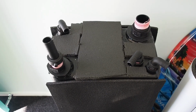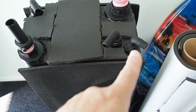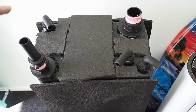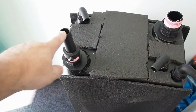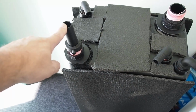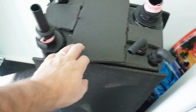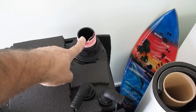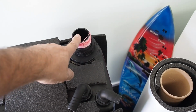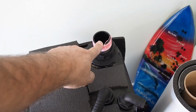Now this is the water tank. This is just a 54 litre water tank. I just got this one off Outback Equipment in Queensland. It came with the 3 outlets. They're all 19mm or 3/4 of an inch. I've added the inch or 25mm for the waste from the shower back into the tank, and also I've got a 40mm or 1.5 inch outlet which will be for emptying the tank, and that will go out through the macerator pump and get pumped outside.